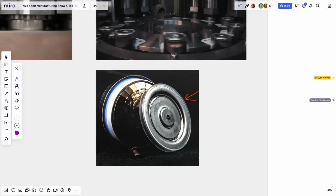What you're looking at here, the cap, is the inside. It's not the outside. You can see it's the exact mirror image of the other one. So where the hole is, it's not on a bump, it's in a valley. So this whole thing is going to be facing this side. Here you don't see the current collector. You still see the flags. The current collector isn't there. But you need to flip this cap around to put it on top of the battery.